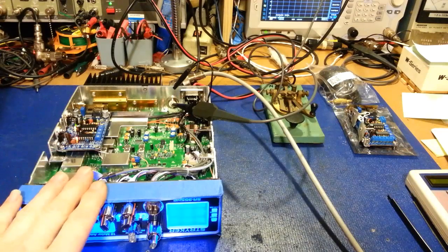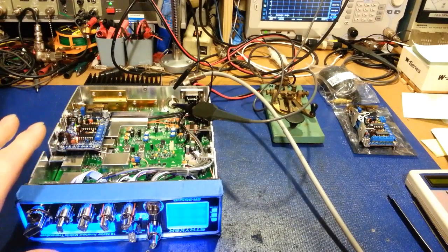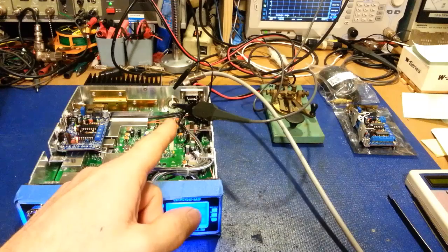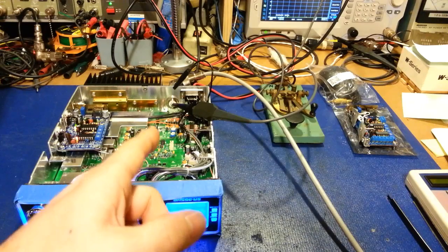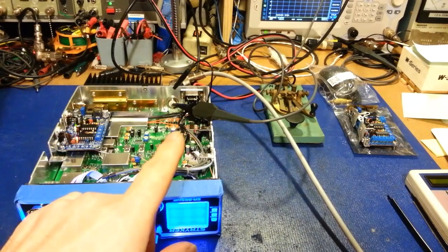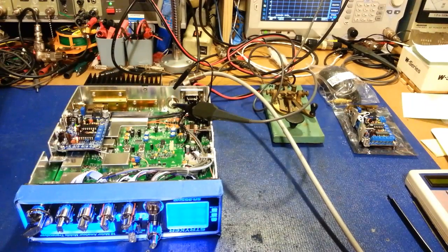Now, this radio has been modified. You can use a stock microphone with it, not recommended, and apparently the Asymod website recommends not using a factory mic, because you're not going to get good audio quality. So what it has, actually behind my oscilloscope probe there, and I have to give the guy credit, man, you talk about some shoehorning to get stuff in there, but done very neatly. He's got two more jacks installed in the back, in between the power socket and the external speaker and PA jacks. Crammed in between there is a 1/4-inch phone jack and a 1/8-inch jack.